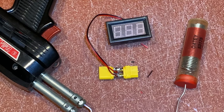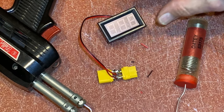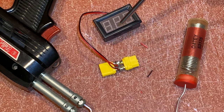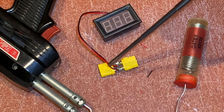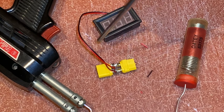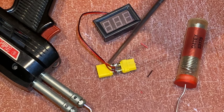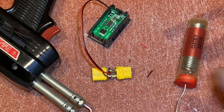Check this out — this is how I'm going to add a voltage tester. Anywhere you've got an XT60 connector with a male-to-female plug, you can add this. I added a male-to-female coupling, soldered the two points together keeping polarity straight, then hooked up the plus and minus wires and soldered them on there.